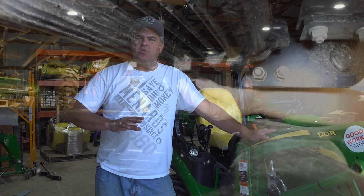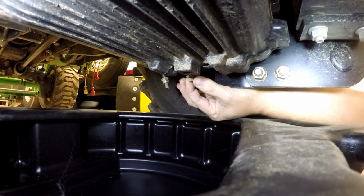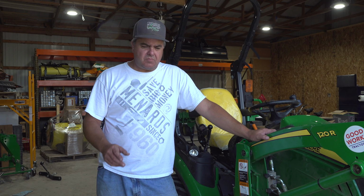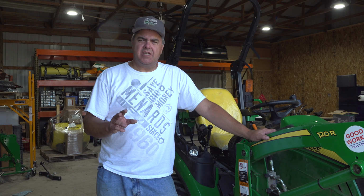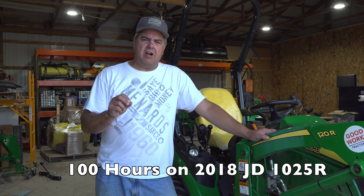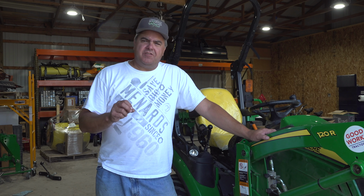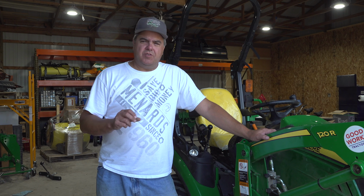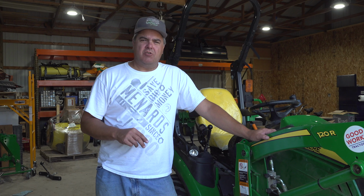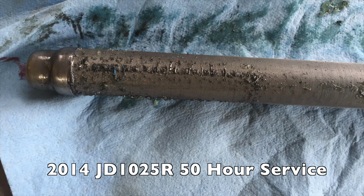Now, we've got a video several years old where I changed the hydraulic fluid in the original Johnny. So you might ask, well, why do we need another episode of the same thing? A couple reasons. First, I'm going to show you a couple things differently. Another thing is that we're doing this at 100 hours. I've got 99.7 hours on Johnny. And the 50-hour service has been removed. They no longer specify that in the book, that you need a 50-hour hydraulic oil change. I want to see what that screen looks like.